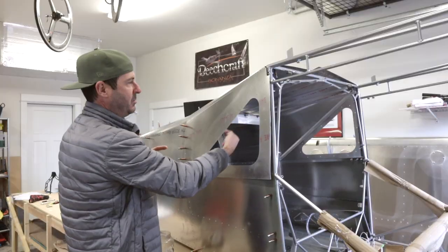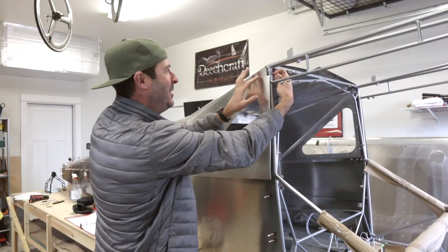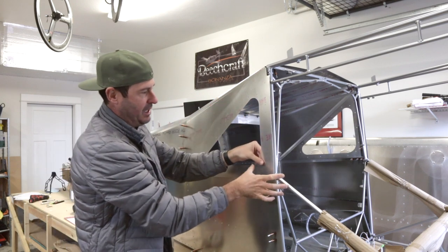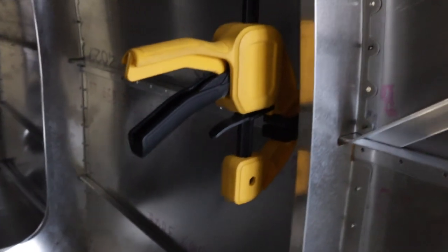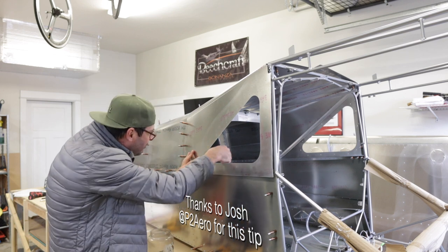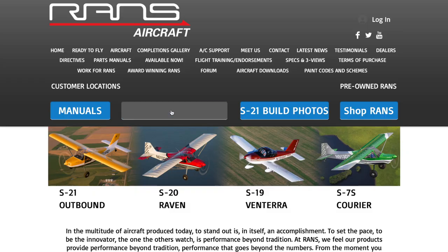With this window support angle I drew a line down the middle so I could line it up and have it centered. Then I want to drill a hole to prevent it from sliding around, and put some clamp pressure here to keep tension on it and prevent pillowing. Something I did a little out of order — I didn't drill, cleco, and rivet the half section of the window support angle yet. The directions say to do it earlier so you can line up that center line both at the back and up front. By the way, if you go to vans.com instructional videos, Eddie Gill has a bunch of good videos about just this portion.